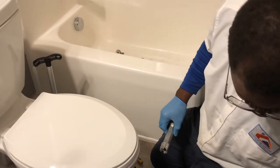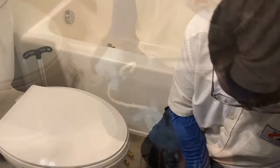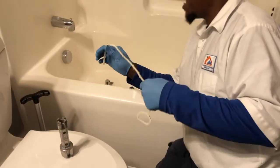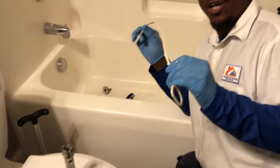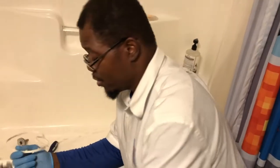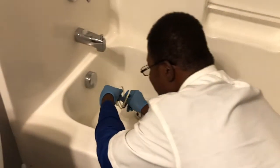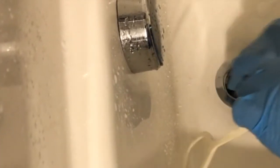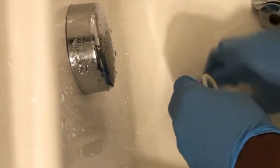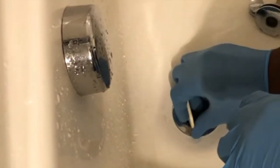If you wanted to check to make sure there's nothing else in the drain, you could get one of these clog removers that has the rigid teeth on it, stick it down there and pull out hair and all these different things. You can get these at Lowe's, at Walmart, anywhere really. That's option A. You just stick it down there, facing it the way the drain goes, so you want to turn it towards the drain. You can stick it down there and snake out anything.